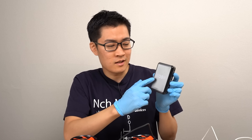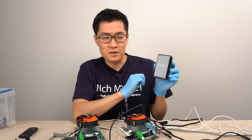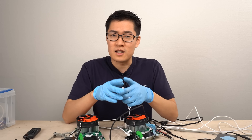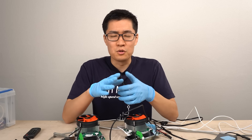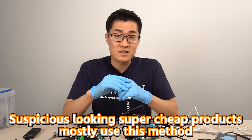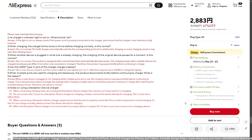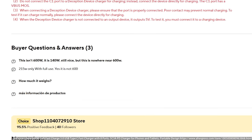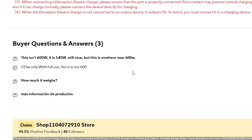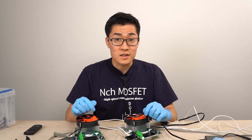The product name '600W' is completely misleading — it's likely not referring to the actual power rating, and 600W is probably just the model number. Not long ago, there was a trend of using '2TB' as a model number for SD cards and USB drives to make people think it was the actual storage capacity. They are probably aiming for the same effect here. In the buyer Q&A section at the bottom of the product page, someone confirmed that the maximum power is 215W, not 600W.